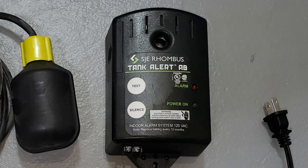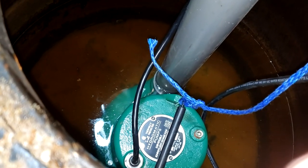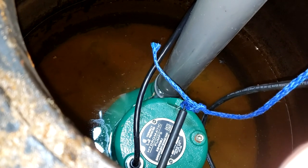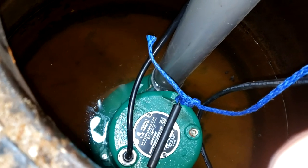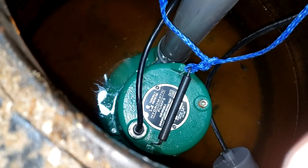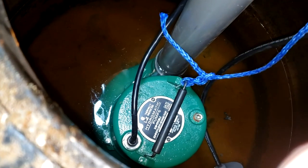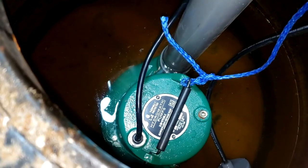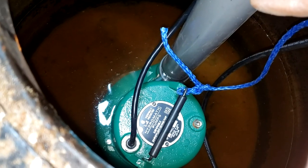We're going to install one other little special piece of equipment called a float alarm. The purpose of a float alarm is that in the event this pump ceases to operate — for whatever reason, whether it doesn't get power or it fails — toilets do not care whether sewage ejectors work or not. The level of water will continue to rise to a point where it's going to have to come out of somewhere. So you want to catch it before it gets there. The float alarm works like the float switch, but its primary purpose is to trigger an audible alarm when the water level gets too high. You want to install the float alarm significantly higher than the pump float, but not too high — you don't want to put it just beneath the lid.